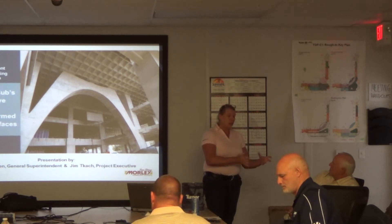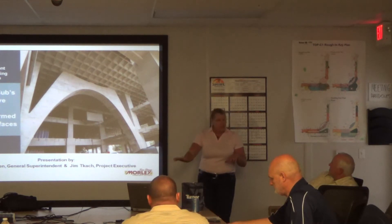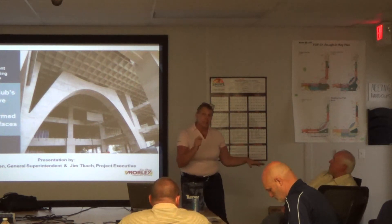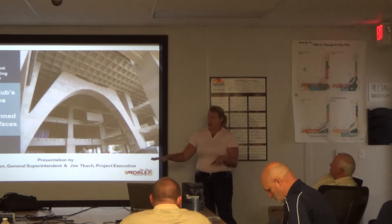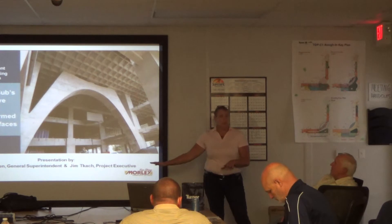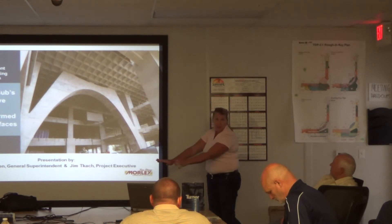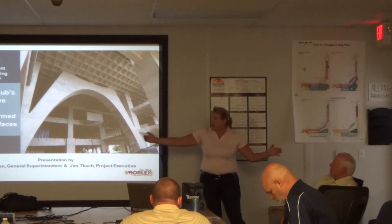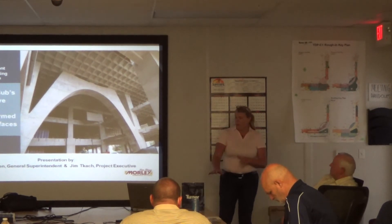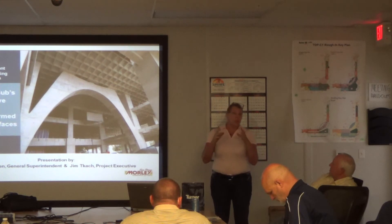Hoists and hoist jump. One of the things we determined very early on this project was that on level one we ended up changing the rotation of the pour from the way we originally had designed it. That was a big deal. We recognized that had we poured the concrete the way we originally planned, where the hoist was going to go was actually in the second section of the pour, which meant we would not have been able to elevate any columns over 36 or do any work, and it would have delayed the entire project. So Morley ended up changing how they poured from 1-2-3-4 to a different sequence. That was a huge project saver, big time.